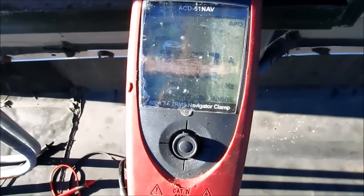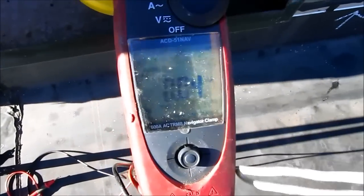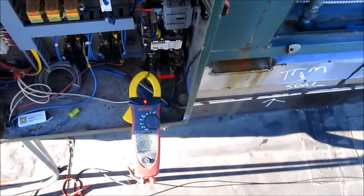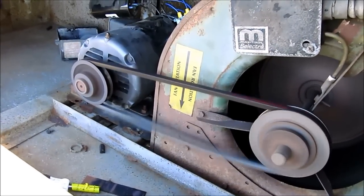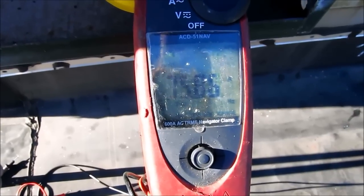Let me get to the motor tension. We loosened up the belt a little and we still got the same — still running 33 amps. I changed the capacitor, put a temporary capacitor on it. Yeah, that motor's shot. The amp draw just goes up — so we've got to get a new motor for this one. That's it for this one, guys. Thanks.